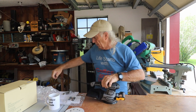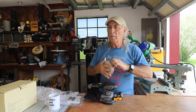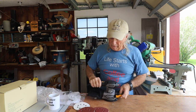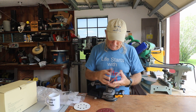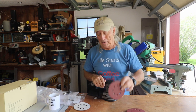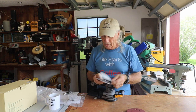We're almost ready to go. I'm working on a project right now, so we'll jump into that. The best part about getting a tool that comes with what you need is you don't have to run back to the store for sandpaper — it's in the box. They have all different grits: I've got 120, 60 — which is really good for aggressive removal — and 320. A 320 is a really high, over-the-top kind of finish. I very rarely go above 220 or 240; that's usually where I peak out.